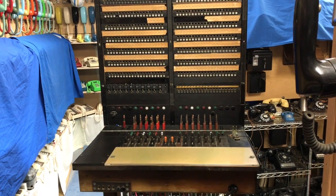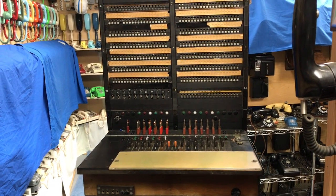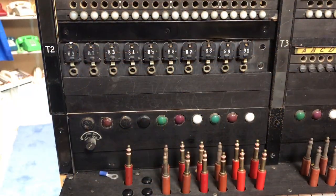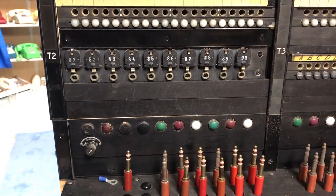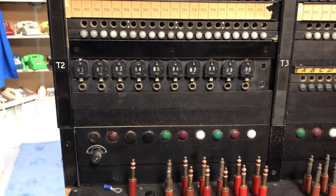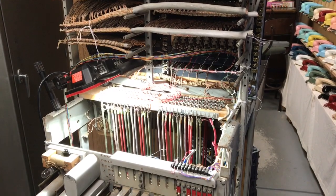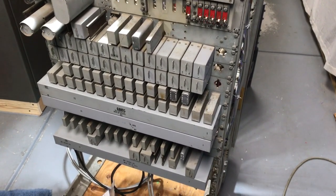This episode, I will be discussing a Number 12 Western Electric Combination Magneto/Common Battery local switchboard. This has a 10-strip of Magneto drops in it. Above the Magneto drops, the jacks above the lamps are 20 lines of common battery. Here is the rear of the jack strips, and below are the relays and common equipment for the Number 12 switchboard.